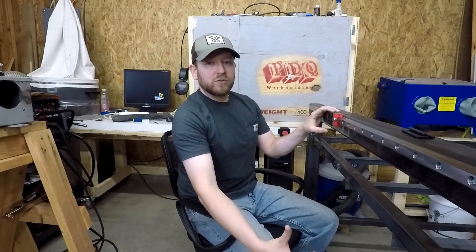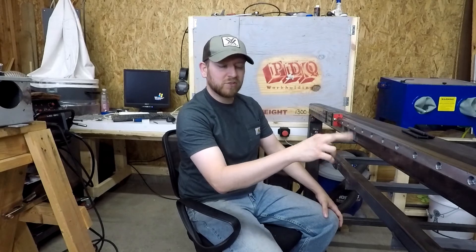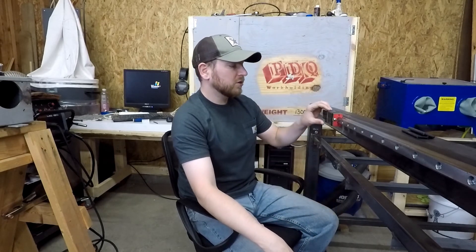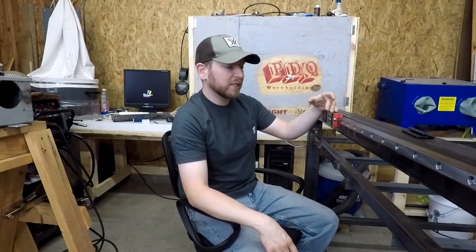We are really getting very close. After that, all I'll have to do is drill and tap the entire piece of aluminum. Doing one of these rails only takes about 13 minutes in mild steel, so it should be pretty quick. The part I'm still tweaking is the Z axis — I bought some proximity sensors to pick up the material I'm cutting, but I think I might end up going with some kind of bump sensor on springs, like what most people use. I should be able to get the motion portion down pretty easily.